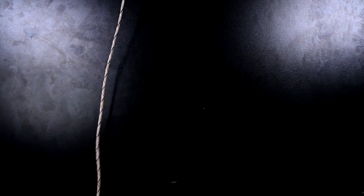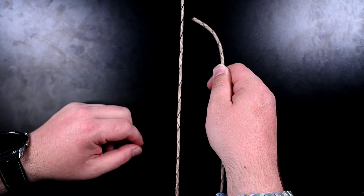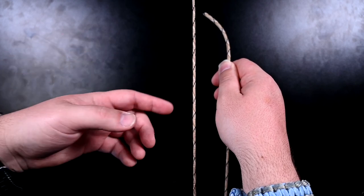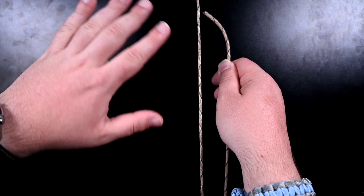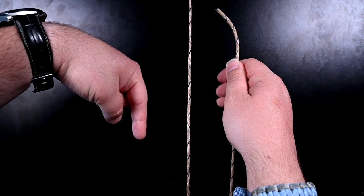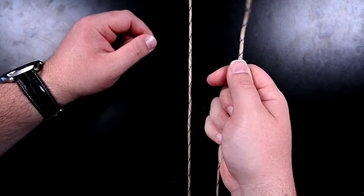I'm going to go around a chair that I have nearby. Now you can see that this cord — I'm going to say cable, cord, wire, all these interchangeably — is tight. This is illustrating you going around your antenna or whatever you're actually attaching your antenna to. In the case of the DX Commander, there are plastic plates, and that's what you're going to use to attach to your antenna. This is the ground side, this is the antenna side. Tension on here — and here is the rest of your rope, the working end.